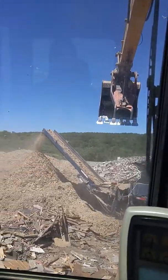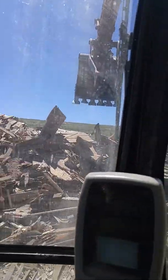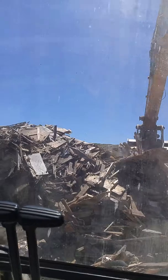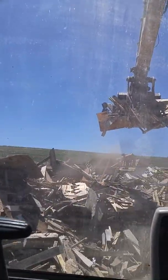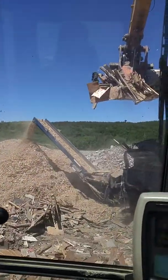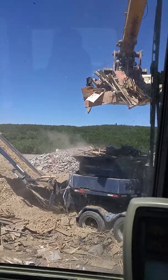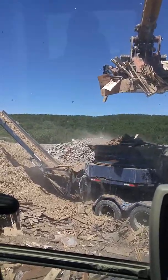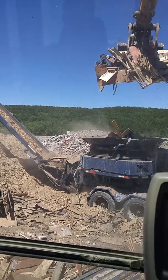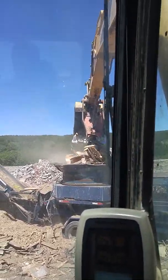We also have to take care of the green waste that's here. And backtracking a little bit, I'm actually really happy with the production for the size of the machine. It's running a four and a quarter Cat, a C15. And it's been good on inserts, good on kicking out material, heavy steel when we're hitting it. I bought this machine with 4,000 hours on it — got it delivered and threw it right away on a job. I'm happy with it.